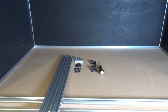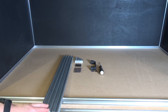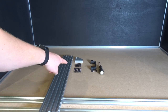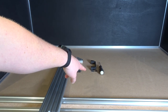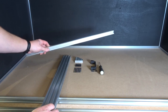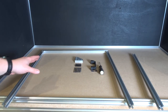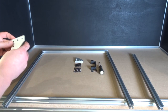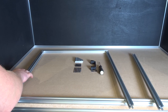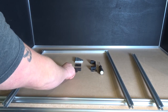On this next step we're going to be building the doors for the front of the enclosure. We need our extrusion for the door specifically — for the 510 configuration the measurements will be specific to this enclosure. We'll also need four 90-degree joining plates, 20 M5 8-millimeter screws, 20 M5 t-nuts, and our door handle, which comes with two t-nuts and two M5 10-millimeter screws. We'll lay out the structure of the door with the longer pieces for the sides, build the structure, then slide in our acrylic. We'll insert t-nuts: two for each side piece, and six for the top — three on the left and three on the right.